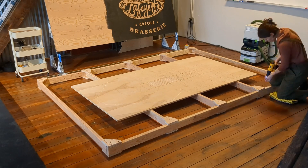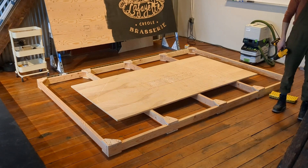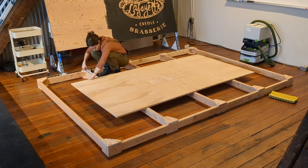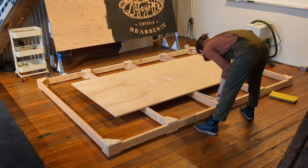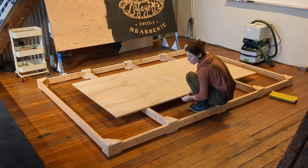All right, just about done with all of the plates. At this point I'm centering up that spoil board in the middle. It doesn't have to be exactly centered, but again for aesthetic reasons I just thought it would be good. When you start your Maslow 4, you can set the X and Y position for whatever the position of your cut or your spoil board is.